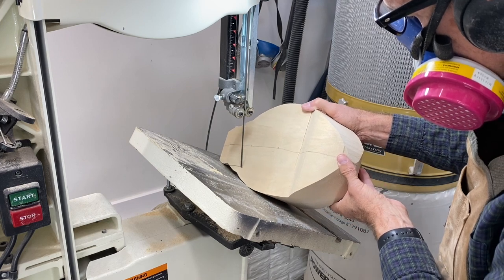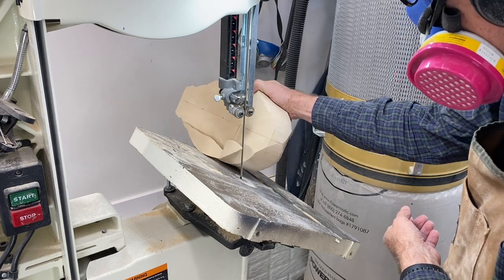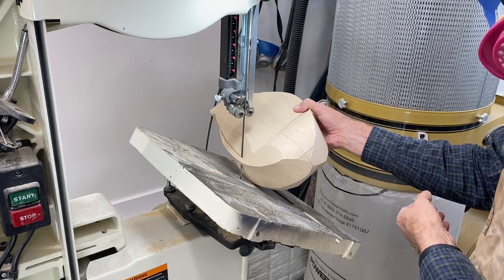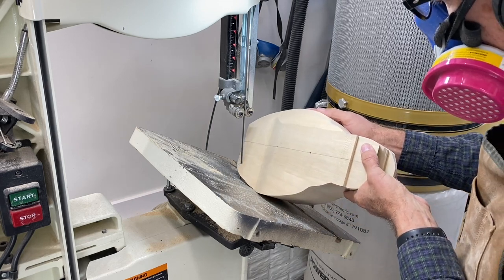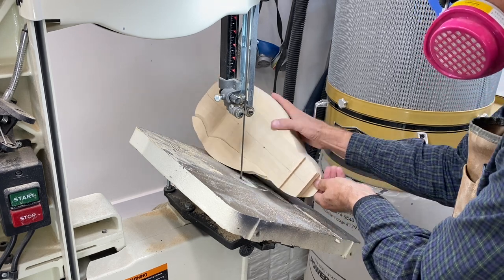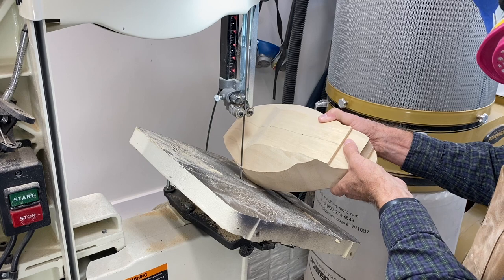You especially want to go slow on these upper body cuts because you're cutting off a lot more wood, and this is kind of a judgment call — you just work slowly so you don't take too much wood off. I normally do a couple of different angles on each side and then call it good and grind the rest. That blade is pretty exposed and it's easy for it to grab the decoy, so use caution. Notice here I'm not taking wood off where the primaries will be, because I want to leave wood there — we don't want to cut that wood away and not have enough left for the cross primaries.